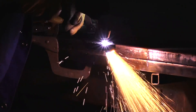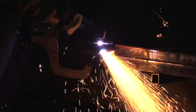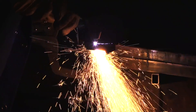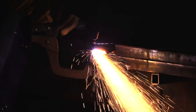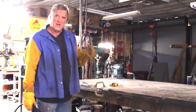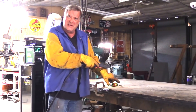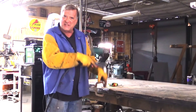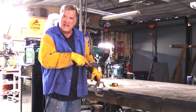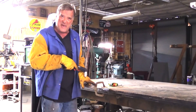If I slow down to let the arc catch up — as I was cutting, you can see the way that arc was sitting there and working back because I was going too fast. It didn't have enough of a chance to cut all the way through. The minute I slow down, that arc just straightened right back out again. Moving along a little bit slower, it stayed relatively straight. Speed up again and you see it just bend right back out of the way.